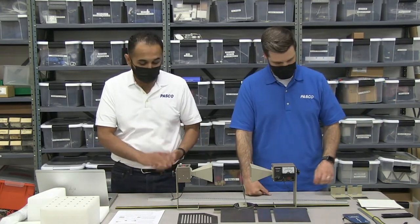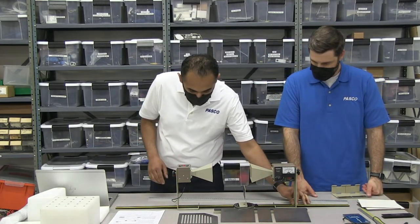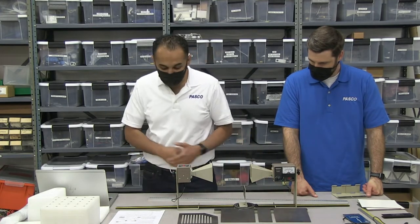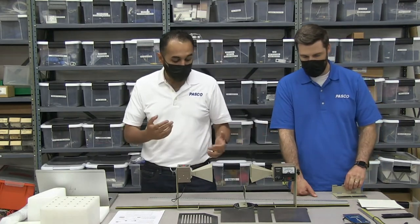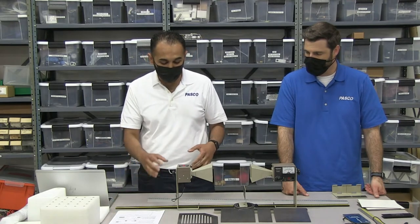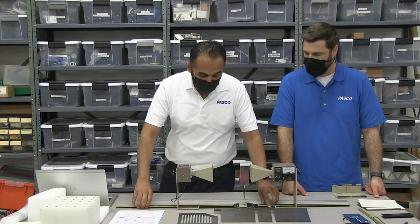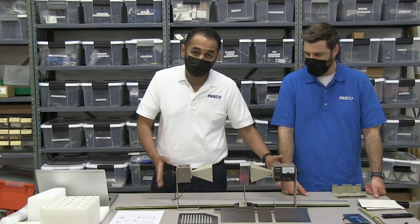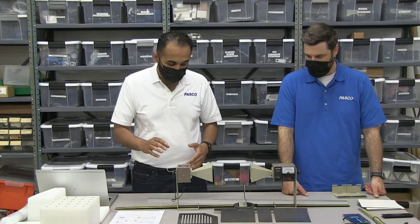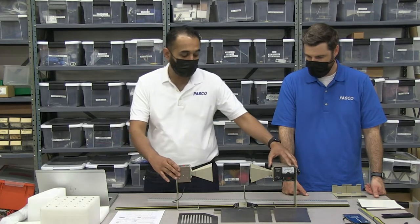For the first experiment, we're going to set it to about 40 centimeters and take measurements at every 10 centimeters. We'll take a reading of the meter and the distance. There are really three readings we're going to be doing consistently: number one is the angle — the angle at which these two are to each other. The second is the distance, how far apart they are. Third is the angle of the transmitter and the angle of the receiver.